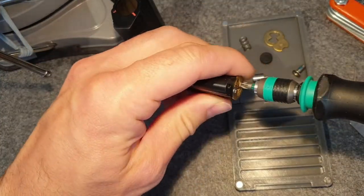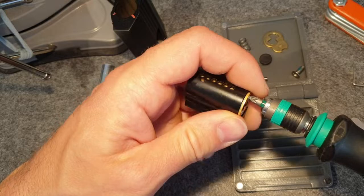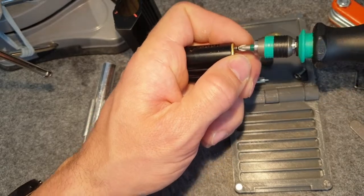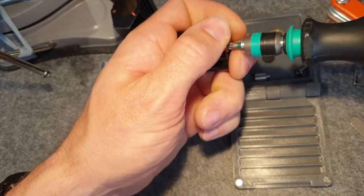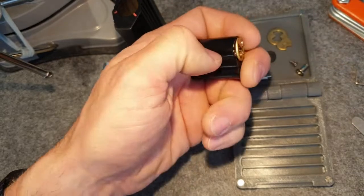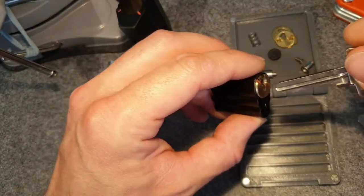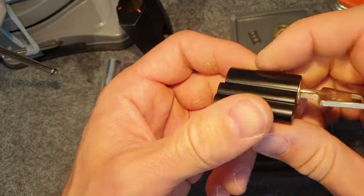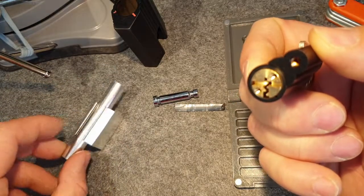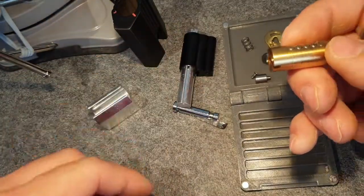This is really nice to cut, actually. Okay, yeah, we're picked. I will lock it back up and it's easier. Okay, this plate comes off. And now when we enter the key, we can just pull out the whole plug. So, a bit careful now. So, when starting, I used a shim, but I've gutted it before, and so it should work out like this, hopefully. Yep. Put the core here.